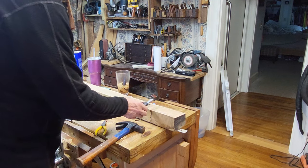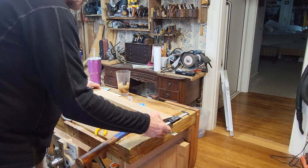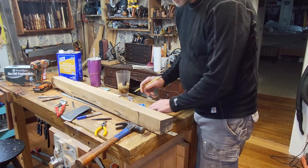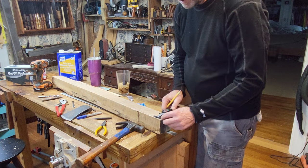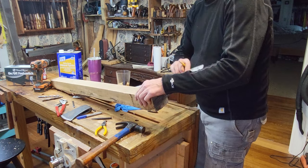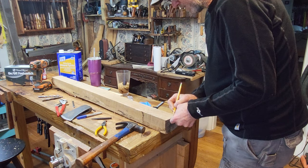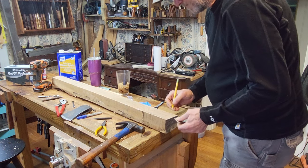So what we want to check is that my shoulder, my pencil go. I had a pencil here, it was just here. Yeah, my bottom is at least 1.8, and it is. And then my top is going to be at least 2, which it is. So we really want to make sure that we're at least an inch each side of the center line. So that's like a drop dead point. And this side, that's a drop dead point. So that's our 2 inches.